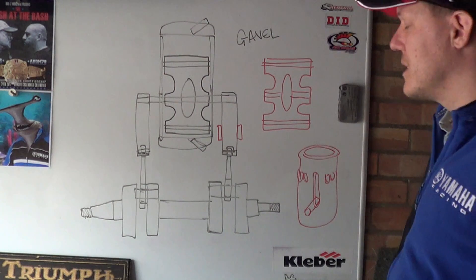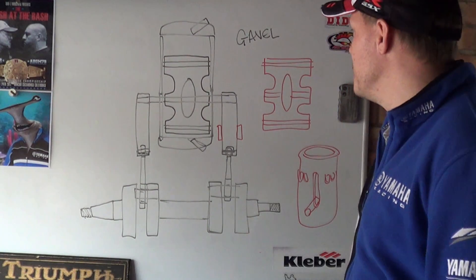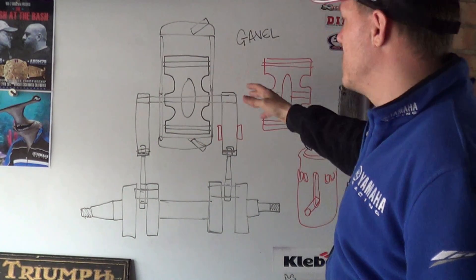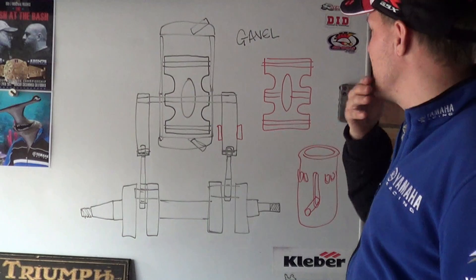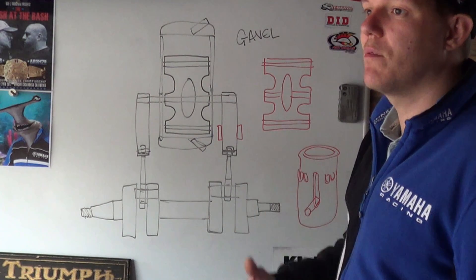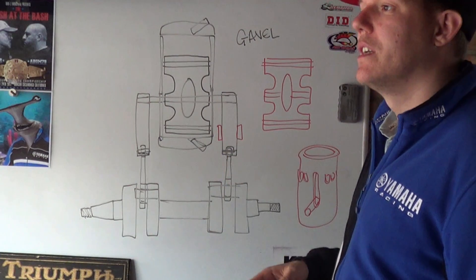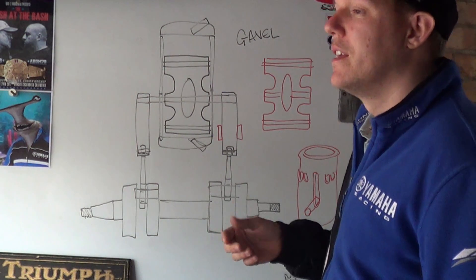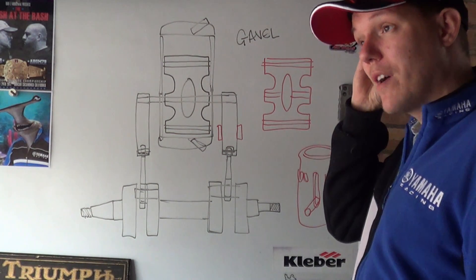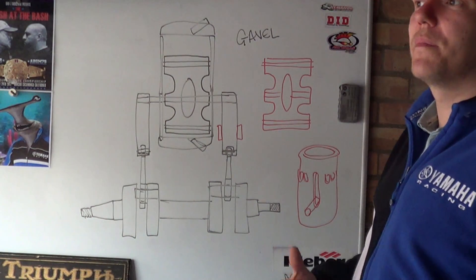In a sense, one of the good things about this design is you're still keeping with the ethos of your two-stroke engine. So it is a two-stroke, it has the same kind of things, apart from you might use direct injection or regular injection with a supercharger. But one of the neat things is how the engine breathes. The supercharger isn't there to actually charge the engine above atmospheric pressure - it's actually there because we're not using the crankcase at all, just to keep the flow moving.